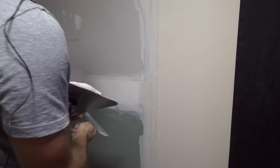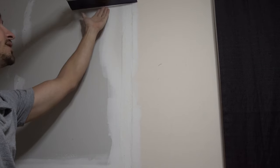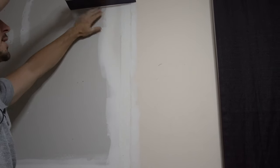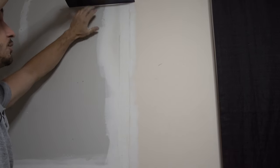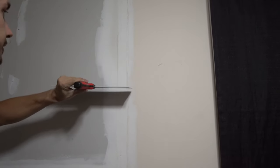I'm going to clean up a little bit around here and then once this dries in about an hour, we'll come back and do our next coat. So we're about ready for our second coat. Whenever I go to do a second or third coat, I like to check how far I am when it comes to needing to add mud. The easiest way is to get your long knife — this is a 14-inch — and look for light coming through. We can see up here there's maybe an eighth to a quarter inch gap, so we know we'll have to add a lot of mud and fade all the way out if we want this wall to look completely flat.